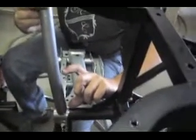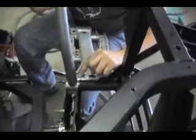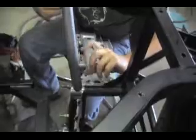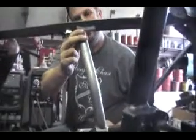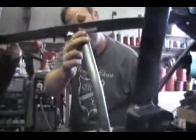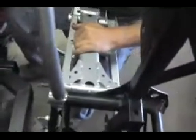Everything's ready to be tacked. One more note: this is four inches from the bend to the pipe to the bottom. So we'll put the four inches here, not on top. Don't go that way. And that's ready to be welded in or tacked. So you tack her in, and then you can remove the arms and finish welding on the front.